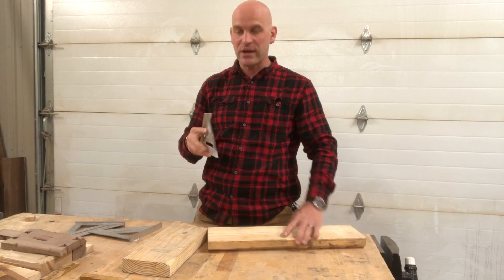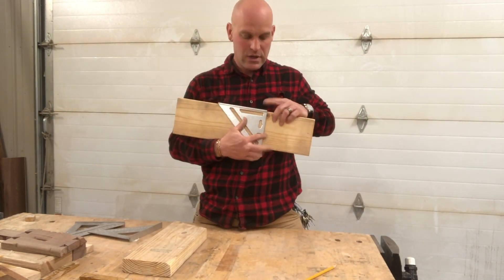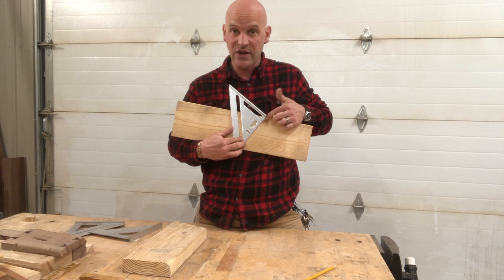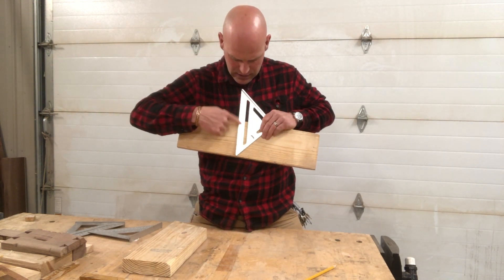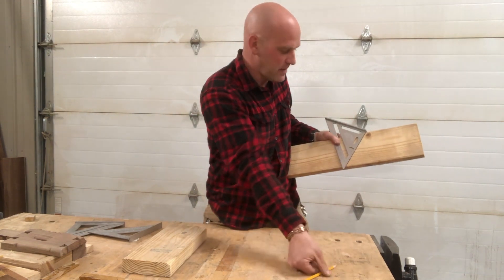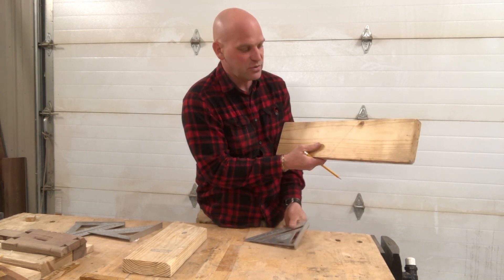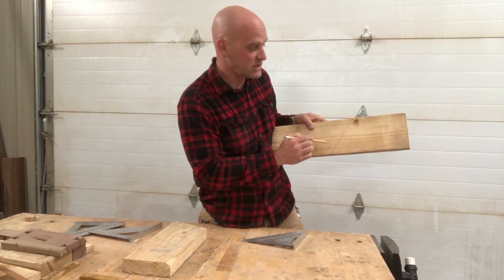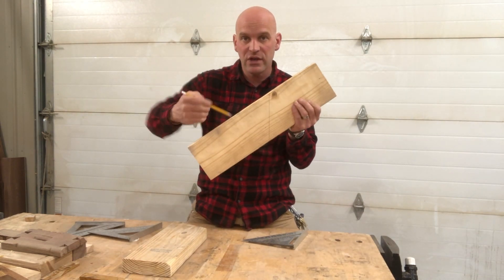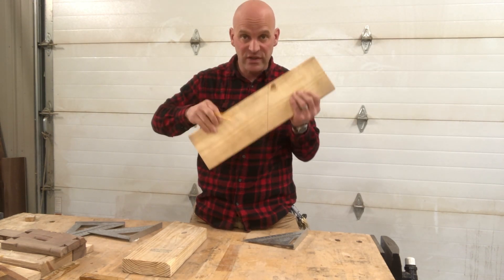Say it's an eight-twelve pitch that I want. I'm going to take whatever board I have, put it on here, line this up where it needs to be as far as measurement, and then I'm going to pivot right here to where this line is meeting up with the eight. Then I would mark it on the pivot side — so I line it up with the eight and mark it. This would be an eight-twelve pitch line right here. Now this is for a plumb cut. A plumb cut comes down here — this is our roof. Levels horizontal, plumb is vertical, so this is our plumb cut.